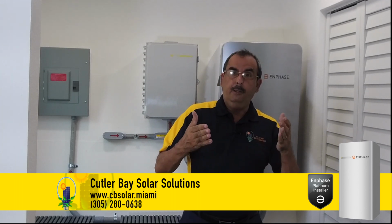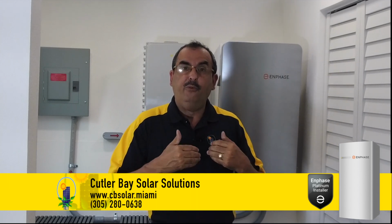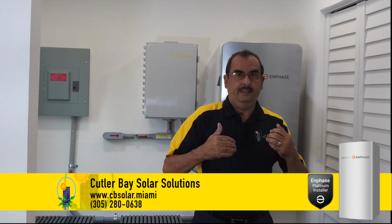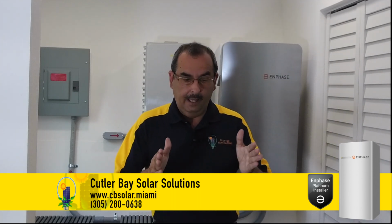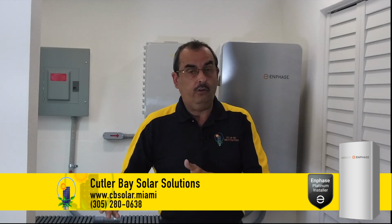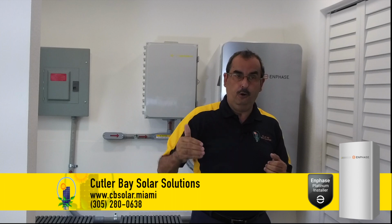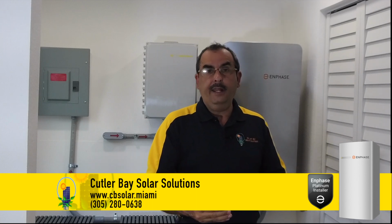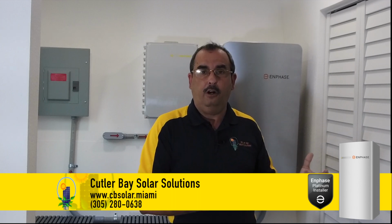Yes, eventually when the battery gets down to 50% charge, the inverters will turn back on and recharge your battery. But they won't run your home, they'll simply be recharging your battery. The battery is what's controlling your home. So now you are locked into a very specific amount of power, day or night. And you also run the risk that during the daytime, because your panels are not producing energy for your home, the battery is being depleted, and you come into a situation coming into the nighttime when your panels can no longer recharge your battery, but at this point your battery is not 100% charged.